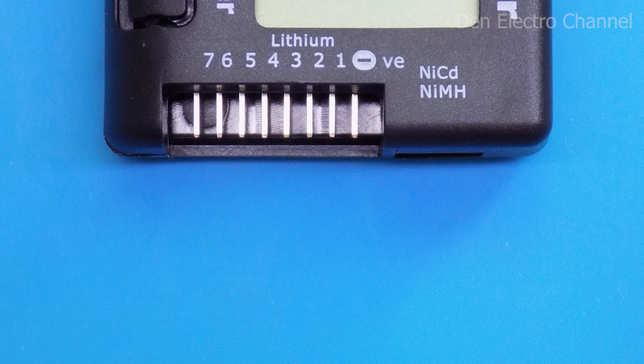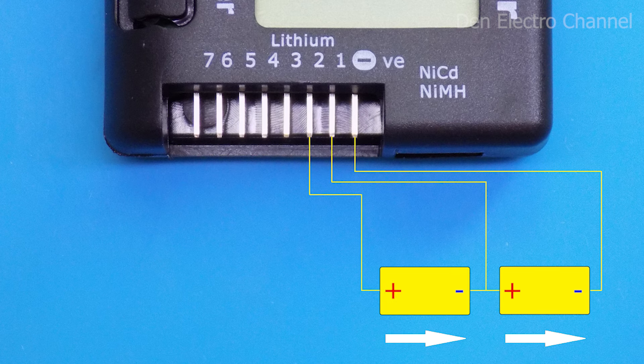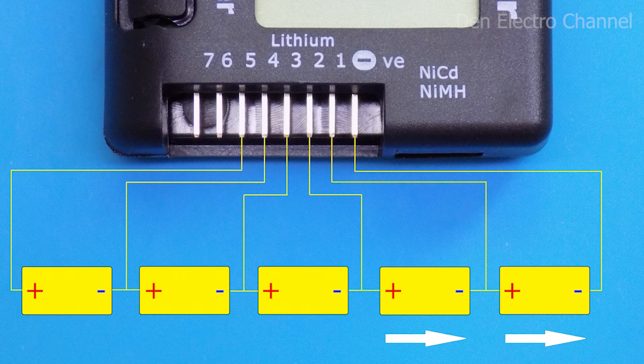The multimeter does not have its own power source, which is both good and bad. If only one battery is connected, the multimeter is powered by it. If two batteries are connected, the multimeter will run on both. If more batteries are connected, the multimeter will still work from the first two. This must be taken into account since, although the device is small and has an LCD display, it still consumes current during operation. Even without a load connected to the batteries, the first two batteries will still discharge over time.